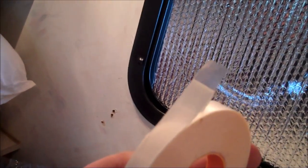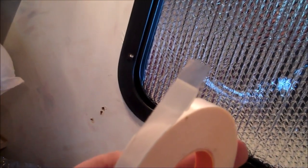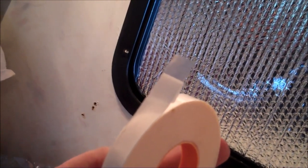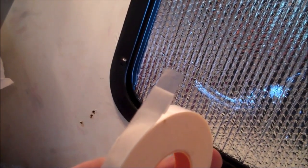I just lucked out — I had a remnant of this window plastic in the box, and it turns out it is the perfect size for this window! Now I'm just going to wipe down the edges so the tape has a nice clean surface to adhere to. The way this works is I have this clear double-sided tape and I'm running it around the entire window. One little trick is I always get the other end of the sticky double-sided tape peeled off and peeled back, so when it comes time to pull the strip off, it's easy to adhere to and I'm not spending 20 minutes with my fingernails trying to get the other side of the tape to separate.